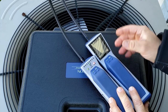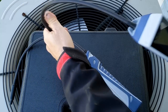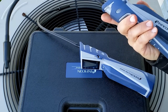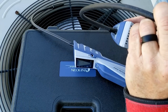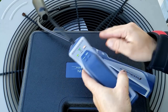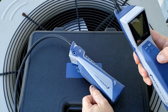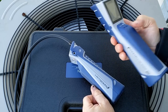Generally I've been running everything in super mode. I don't really get too many false alarms, even if I smack the probe on something — a lot of detectors will false alarm when you do that, but this one doesn't. The D-Tec 3 is the same. If you blow into it in super mode it will trigger, but if you go to high mode it doesn't false alarm. Super mode is the most sensitive at 0.03 ounces per year, which is an improvement over the Select which was 0.1.